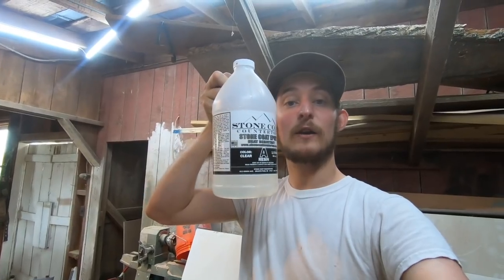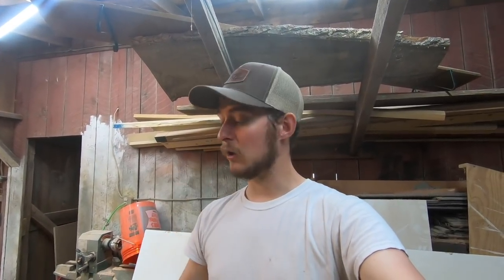If you haven't seen my other video, which I will link up right here, that's the video of the yacht table. I used the Minwax sanding sealer to seal the edges for that river. So it does work, but I always recommend using Stone Coat Countertops or whichever epoxy you're already using. I will say, Stone Coat Countertops has an epoxy called Quick Coat, and I will link that down in the description along with the Minwax sanding sealer, and that's what I would use if I were you to seal these edges.